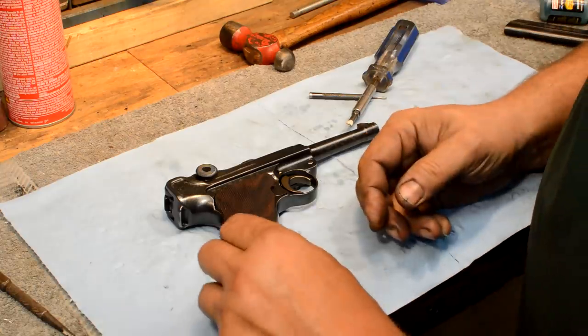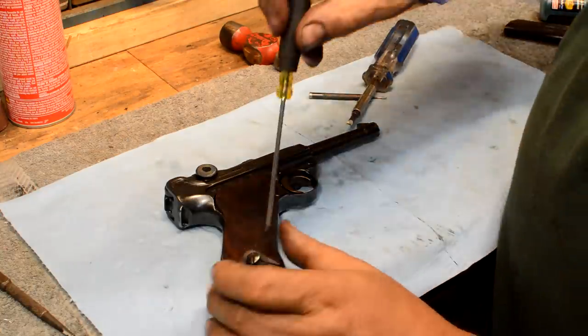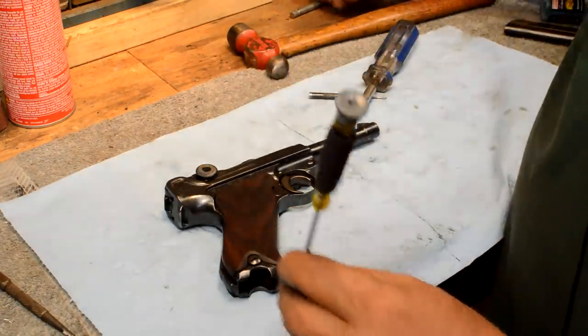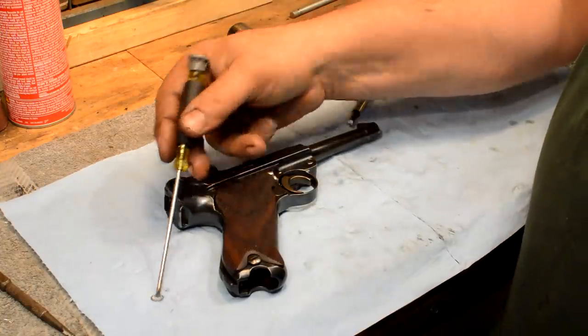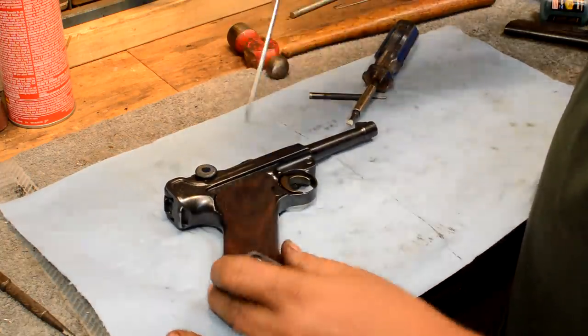All of that is held in with a now non-glitzy screw that looks a lot nicer. When this gun came in there were lock washers up underneath this - I don't understand that. I think the mortise for this grip screw was too big. The white hardware-store lock washers - if you've got one of these things in your gun, it was probably put there but it doesn't belong there. Just don't do that.